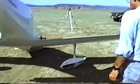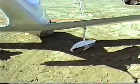About a foot and a half below the top of the rise, the main gear hit, and it folded the main gear back about 30 degrees, broke both axles off, twisted up the scissors, and messed it up. But the result of all of that was that the gear failed, but the gear is attached to the front face of the main spar. There was no damage inside the wing at all. The reason that happened is that I made sure that the landing gear was weaker than the attachment at the wing. It was about 15% weaker. And it worked just great. So I don't have to get back in the wing and try to repair the wing.